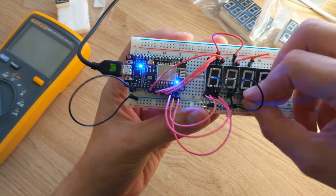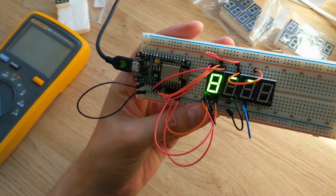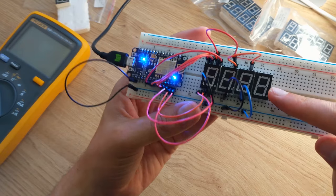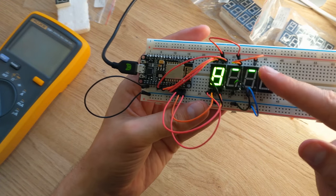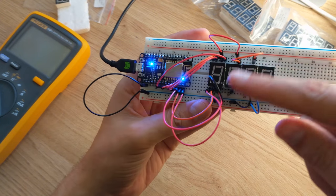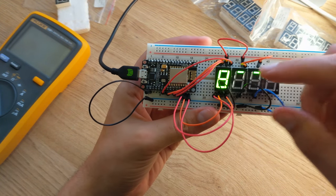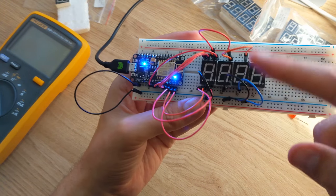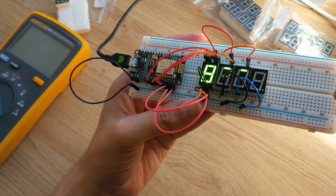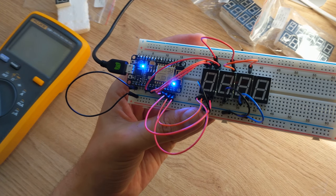Here I've shared the pin for the top segment with the second and third LED displays. If we did this for all the other pins, we'd see a flashing 8888. So if we had a way to just enable a single LED display at a time, and quickly cycle through which digit we're displaying and which display is active, we could reuse those 7 pins to drive the 4 LED displays.